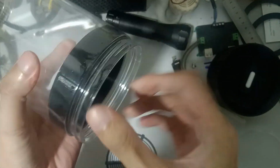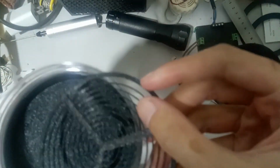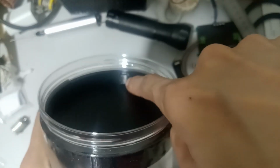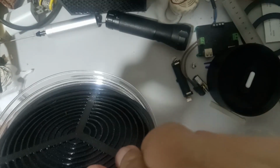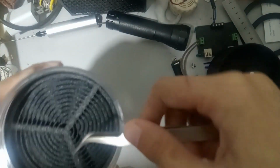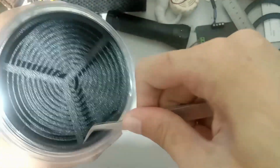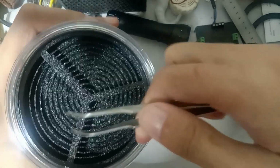With this, we will be able to install the final upper plate. Once they are at the lip, squeeze the jar to grip the pieces. Take the upper plate and align the tab to the upper slot of the ring earlier. This one is perhaps the trickiest of all because you will need a tool to pull the tab should they get stuck inside. I highly recommend having a tweezer to do this. They should be somewhat springy if all the tabs are inside, and that's good.